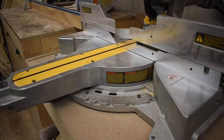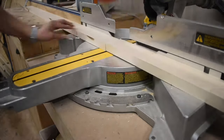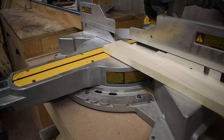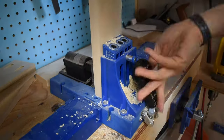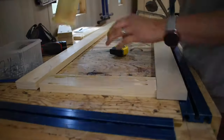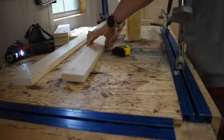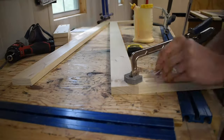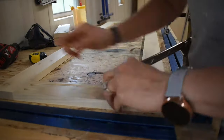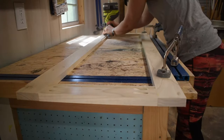When I'm cutting down wood I always cut off the ends, even if I buy them from a hardware store and they look square, because you're never really sure if they are. I've learned the hard way that even if it looks square doesn't mean it is. So cut off them ends, and once I had all my wood cut down to size I took it to the Kreg jig and drilled all them pocket holes. I like to clamp mine down to get everything flush and perfect so that there are no ridges between the pieces of wood. Just clamp it, glue it, screw it — bam bam bam, my frame for my mirror is together.